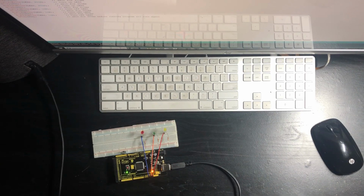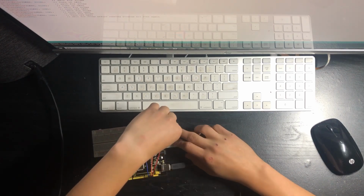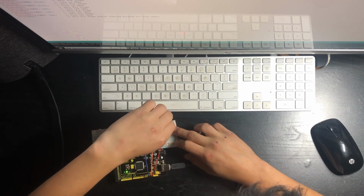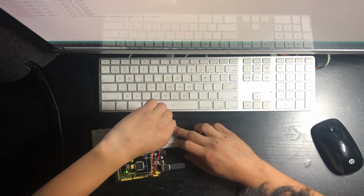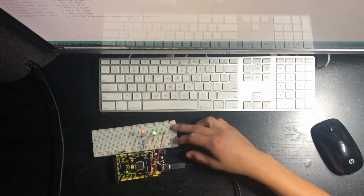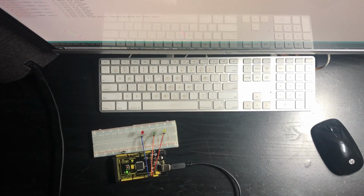As you can see, the first one may not be working. That is because I put them in the wrong spot. I put the positive in the resistor. As you can see, it did not work. I switched it and it powered on and it kept the sequential blink. So make sure that your LEDs are connected correctly if you want it to work.